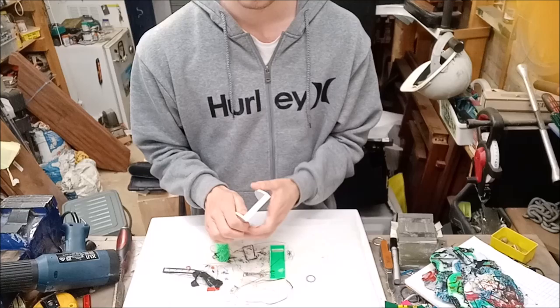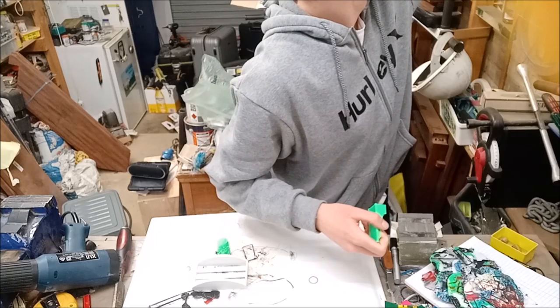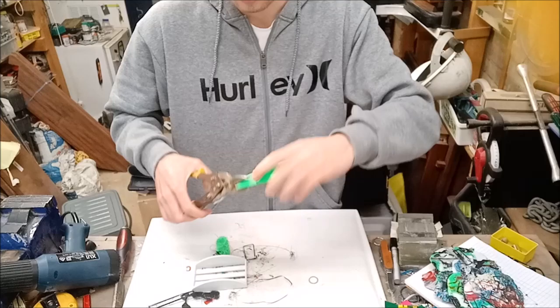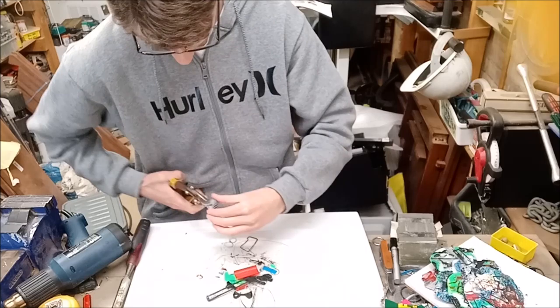These stringy bits and rafts are really easy to melt down with the heat gun, but old prints are rigid, they're tough, they take ages to melt down. So what you want to do is get something sharp or blunt — smash them with a hammer or cut them into little bits. I've been getting a pair of tin snips and just brute force snapping them.